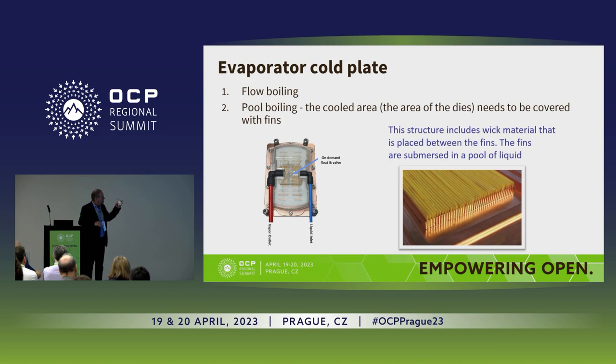This is different from cold plates or single-phase air cooling, where you always have entry and exit at different temperatures and different temperatures across the die. In this case, all of the die is at exactly the same boiling temperature. The white part visible in the picture is actually a float — a float that controls the flow of liquid coming in, because there is almost no flow. Flow only occurs to keep that pool full at all times, done automatically on-demand. When boiling happens, vapor comes out, the liquid level goes down, the float goes down, and a small orifice brings in more liquid. So each one is fully automated and on-demand — meaning you can have different CPUs and GPUs in the same rack, each getting the amount of liquid it needs, some idle and some working, with no need to calculate or regulate anything.